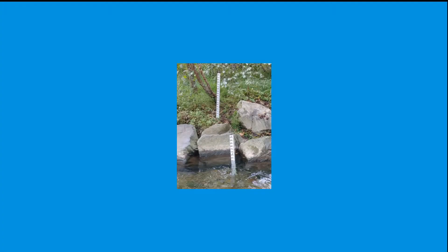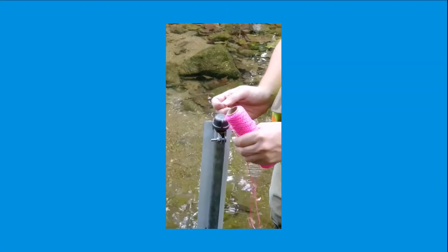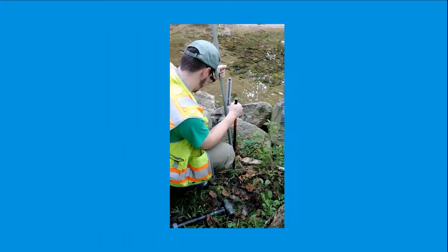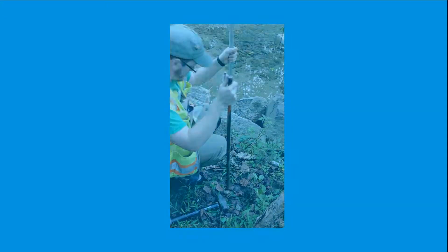The current tactic in reducing the risk of damage to the staff gauge is set up as follows: drive a 5-foot black iron pipe into the stream bed local to the sensor bundle and attach a 1-meter staff gauge ruler to it, then cap the pipe with an iron cap. Wrap and attach a spool of nylon string to the 5-foot black iron pipe so that the line touches the top edge of the staff gauge ruler when tightly unspooled. Tightly unwind the nylon string towards the stream bank, using your eyes to roughly level the string from the staff gauge to the stream bank. Use a piece of rebar to mark a potential spot on the stream bank for the second staff gauge and wrap the nylon string around it.